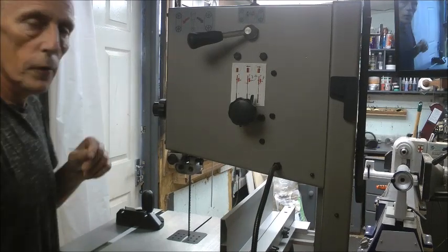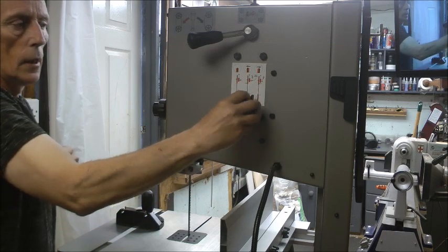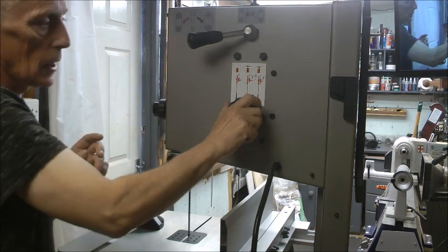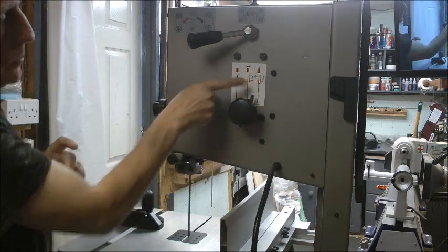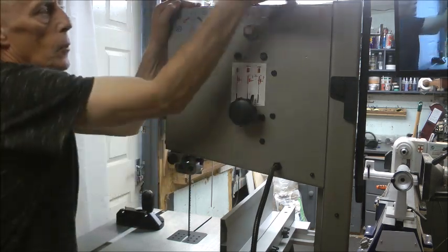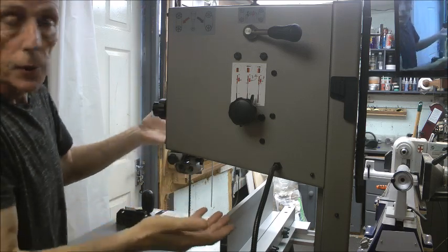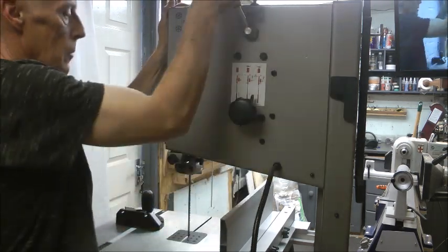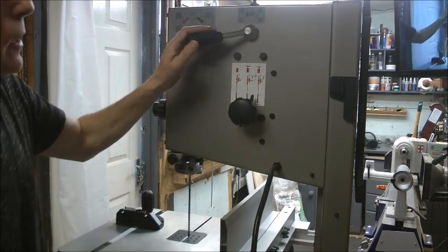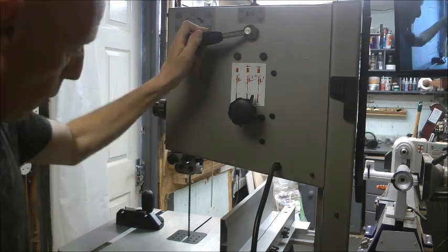Okay then, the top half of the machine, at the back, is your leveling, to the tracking on the blade. That's how you deal with that, and it explains to you on there. That is a quick release, so it's quicker to change the blade. You leave it set at the same and just bring it down, and it's quicker to get the blade changed and whatnot.